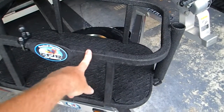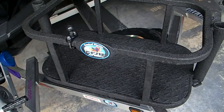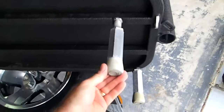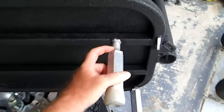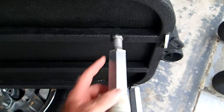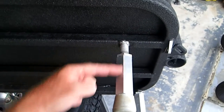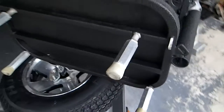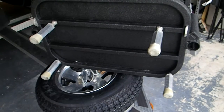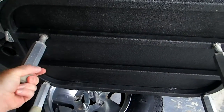The other version I saw was three-eighths or three-quarter inch steel or stainless steel rod. The feet don't have the same diameter — you get really tiny feet. If this aluminum rod just had a rubber foot on it, this rack wouldn't be beneficial, because you've got 50 pounds on something that small a diameter on your deck, and it's banging. Even if it's secure and you're hitting rough seas and bouncing, you're going to wear through your mats in the back and you're going to have holes.